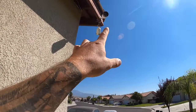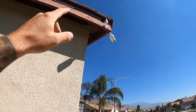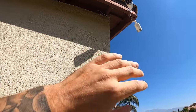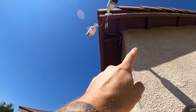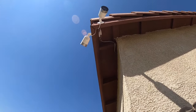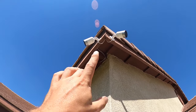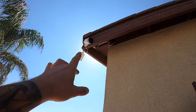The other camera faces out toward the street. One reason I put these two cameras close together is it makes the wiring much easier — you only have to drill one hole and run two cables to one spot. I just drilled through there and ran them all in the ceiling, which was the simplest approach. I came through and used a staple gun to staple everything in place, putting all connections underneath the fascia or roof overhang so rain can't mess with anything.